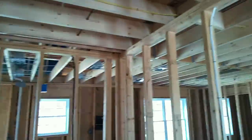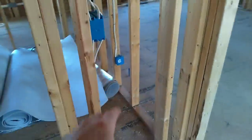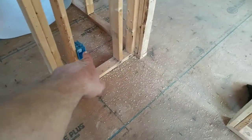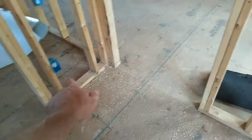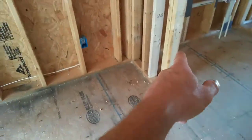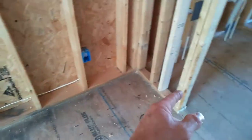We have an overhead light and a sprinkler in the closet. There's a light switch for the overhead light. This wall here is over 24 inches, so technically I have to have an outlet here — it's not going to get used much and the door opens against that wall, so it'll be covered up 90% of the time, but to code I have to have it. This wall also has to have an outlet, and from this corner I'm within six feet.